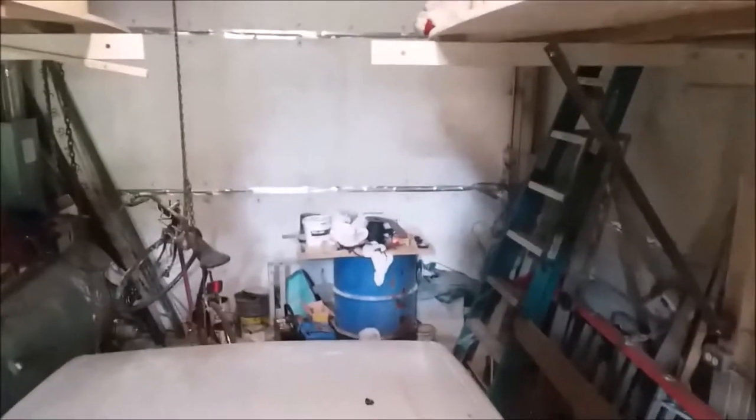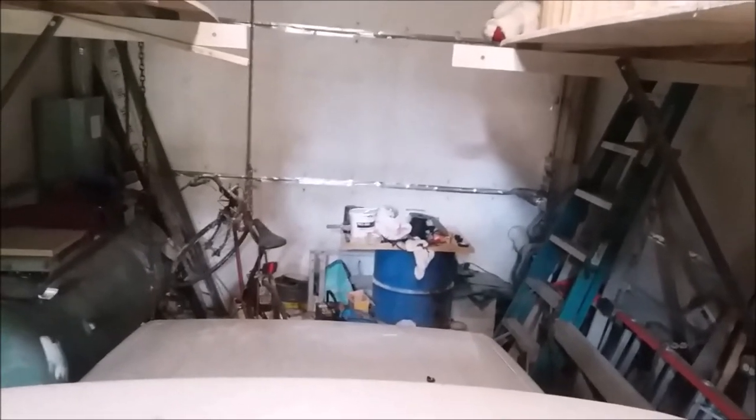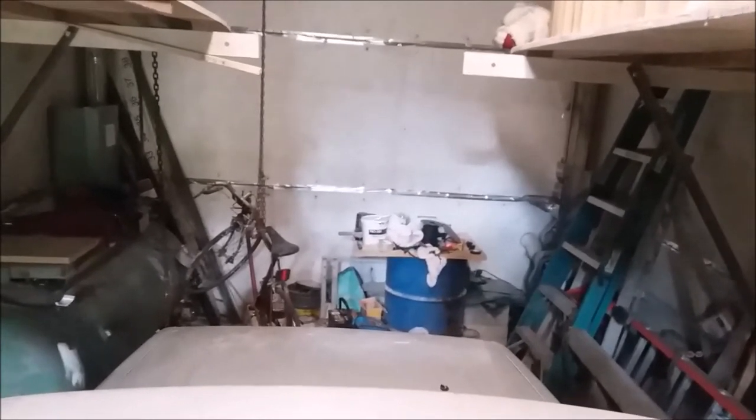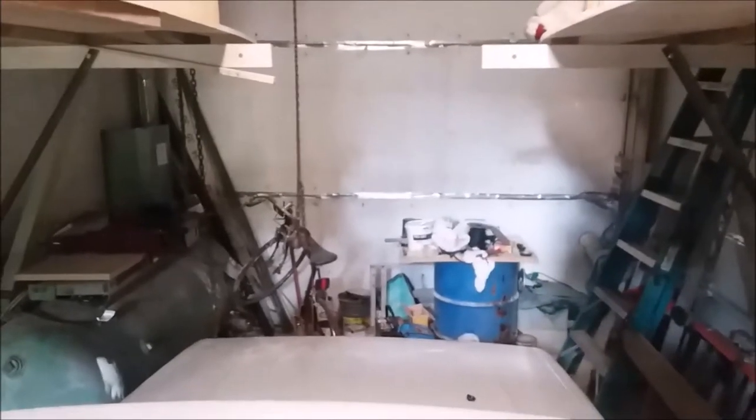And that back there, on that barrel, is where I set my scale to mix composites. And there's a chart that's fell down. I don't know where it went. It shows you, dump in what you want for the first component, like component A of your epoxy, and then you see what it says on the scale. And you look on the chart to see what to bring it up to get the B right. So half of it's easy to measure. You just dump some in, and then you look at the chart.